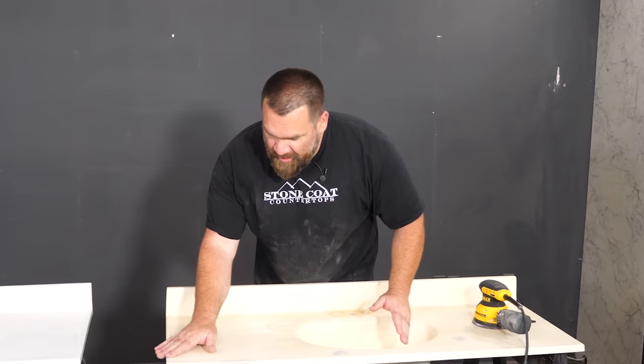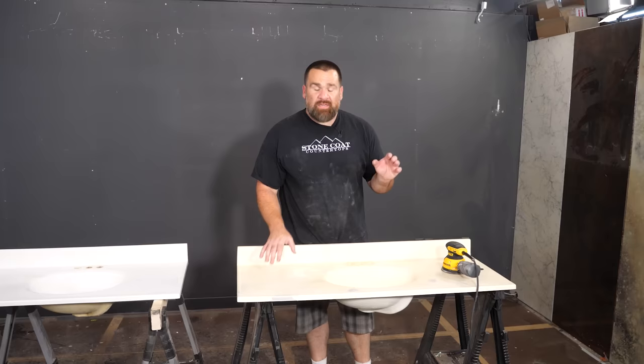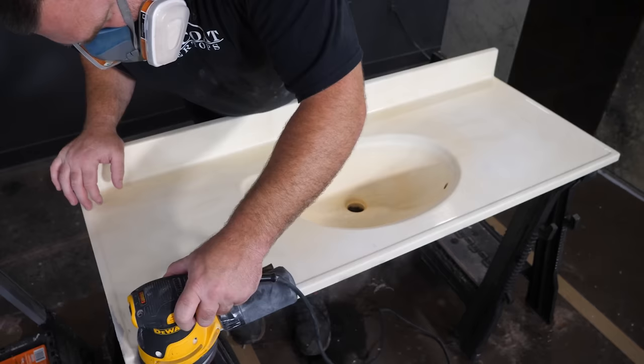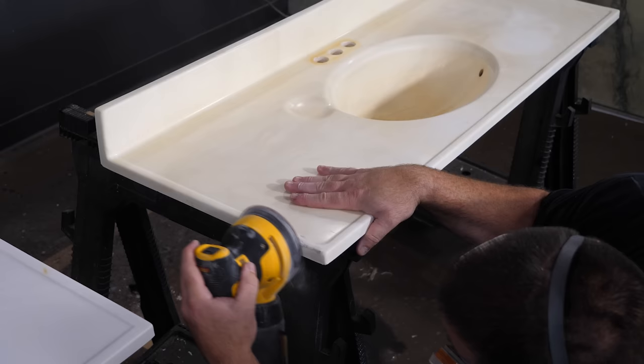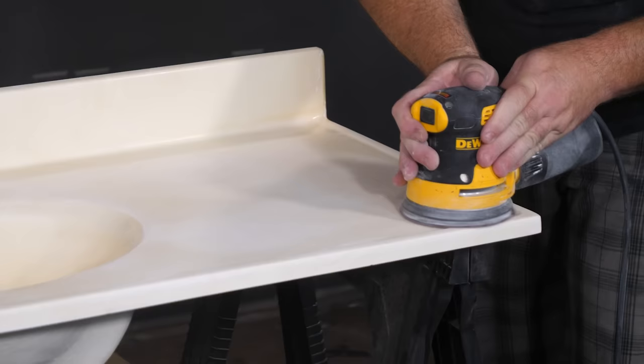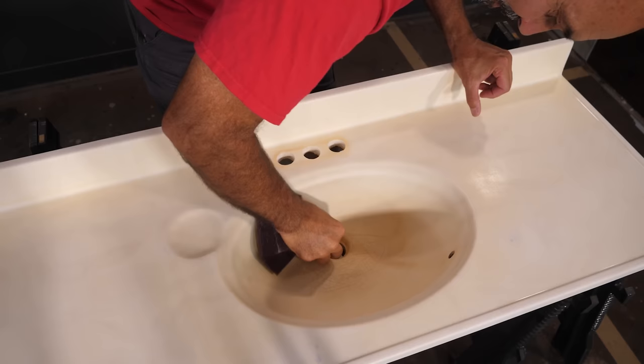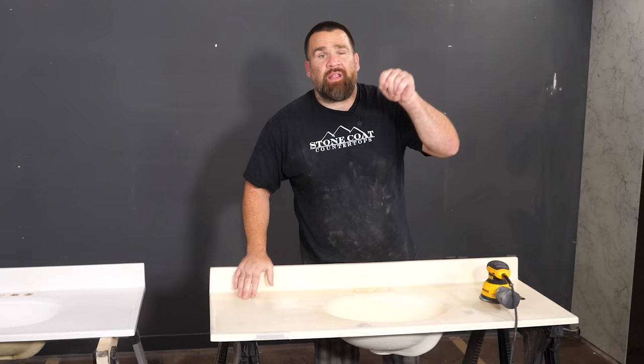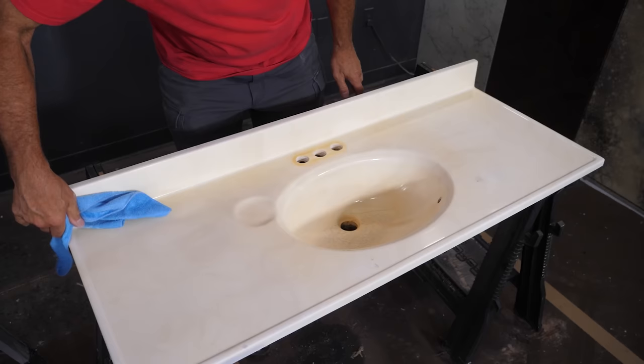The Bondo's cured up — it's nice and dry. It's time for the next step. I'm going to sand that back flat with 120 grit sandpaper, then use that same sandpaper to rough up my edges, surface, sink bowl, and backsplash. Then it's time for the bonding primer. You always want to use bonding primer when going over slick surfaces. No need for bonding primer when going over wood or MDF.